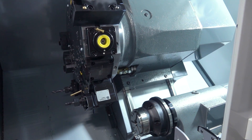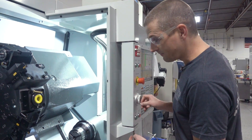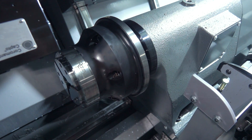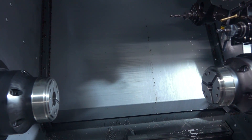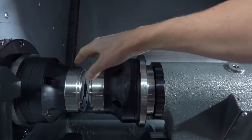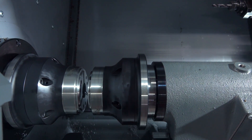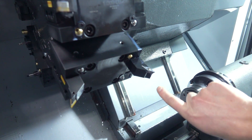This is the finishing subspindle, and it itself is an axis — the B axis. I can literally jog it forward, which is also a bit horrifying because this is one of the reasons dual spindle live tool lathes can get complicated. There's nothing stopping you from rotating this and crashing a tool holder block into this chuck. We can have the front side of a part done here, and the subspindle can come up. Fusion can handle this whole program — the handoff and so forth. We can have the part held with both chucks simultaneously synced together, both grabbing the part, which gives you a cleaner parting operation. Then the subspindle takes over, pulls your part back into position, and tools mounted on the backside of our turret — like this V insert — can come in and finish off that part.